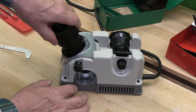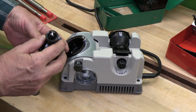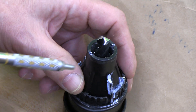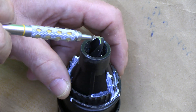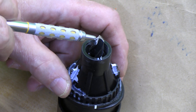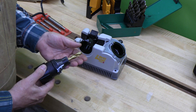It's getting a little bit less and a little bit less. Let's take a look at that. You can see the grind marks — as I rotate this bit, the cutting edge is perfectly clean. There's a little of the black oxide not ground off, but that doesn't matter because it's not as high as the grind. This grind edge is perfectly sharpened — this bit is good to go. Notice again the chisel point, not a true individual point, which is typical for 118-degree standard bits. That bit is sharp.